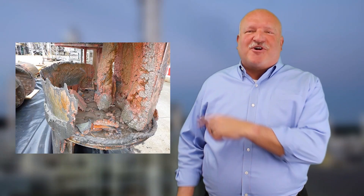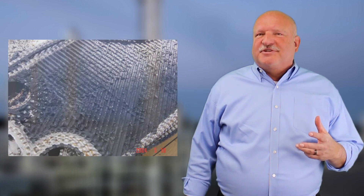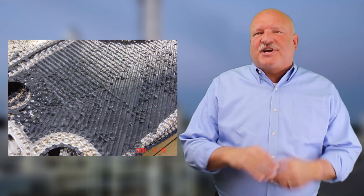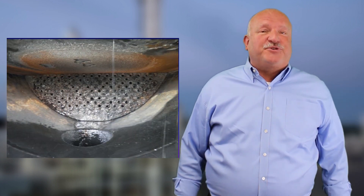Does this mess look like the bottom of your contactor in a turnaround? Do your maintenance staff look like coal miners when they come out of that contactor? What about your exchangers? Are the plates fouled on the rich side? And if you've got shell and tubes, do you see actual black shoe polish extruding out of the tube sheets? Can you even see all the tubes in that tube sheet? If this sounds familiar, you've got a problem. Stay tuned, we're here to help.